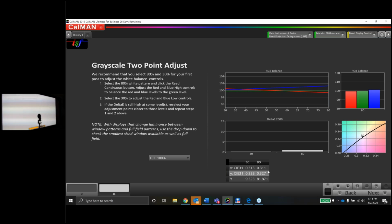Press OK. And just a couple of clicks of probably 1, 2, 3. 313329. Let's check the dark end one more time. 314330. It's very close, but this is a positive green error, which I don't like. So let's change the offset. Let's change it to offset blue. Maybe add a click of blue into the offset. And we're 313329. One click of blue fixed it.